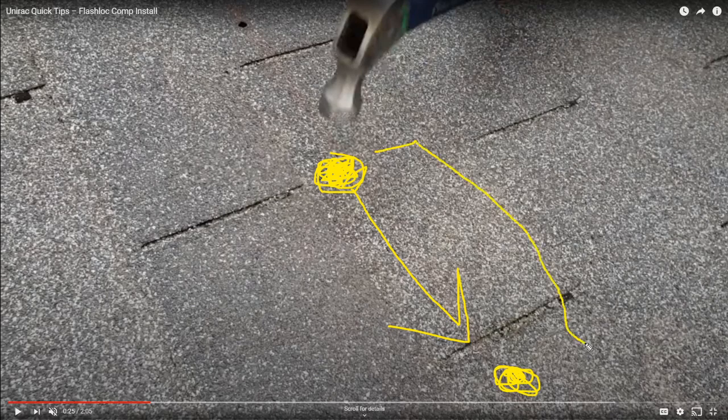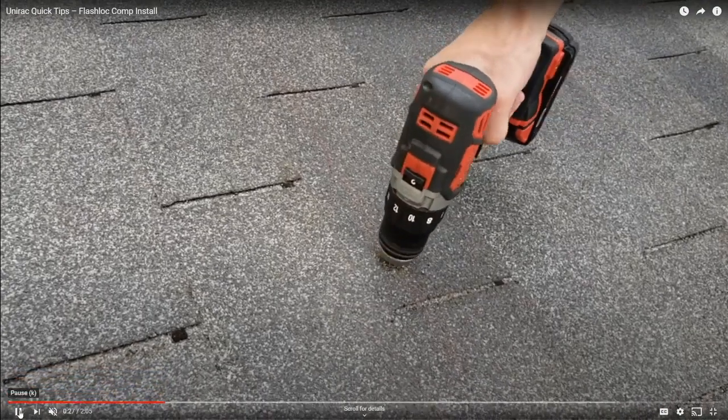And then I'll measure the distance between the two. And if that is consistent with the spacing that I've measured inside the attic, then I know I'm on track. And so I'll actually do that at different points along the roof, form a grid, form a chalk line, hit the rafters. We're going to talk about all of that in a couple of days, probably on Thursday. So for now, we'll call that an advanced technique.